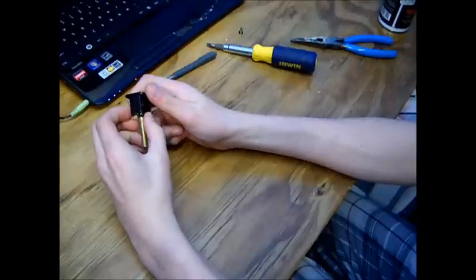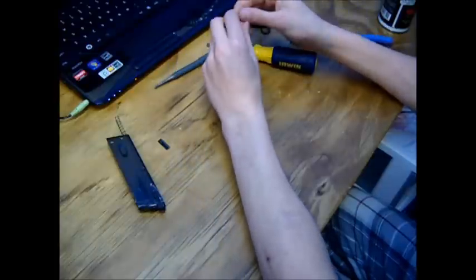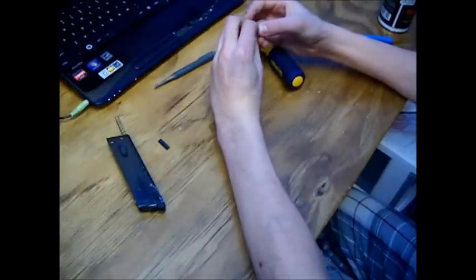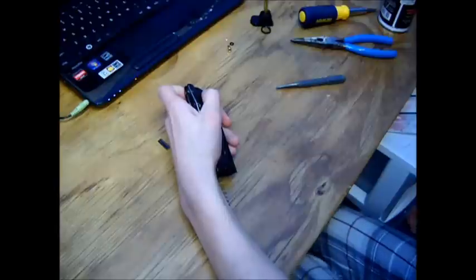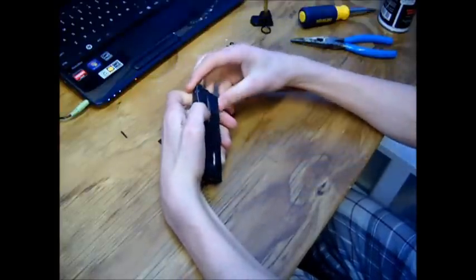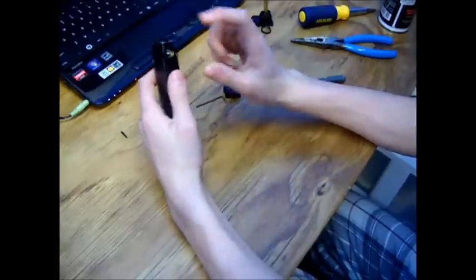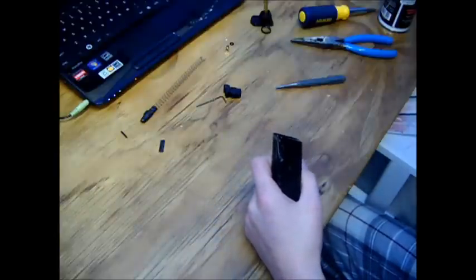And then you have an O-ring right here. This is well lubed so I don't think it's this — I think it's my fill valve. This O-ring is new so it can't be this O-ring. Now the last thing to check is the upper lip. If you find a small L-punch and punch it out, it's just one pin right here. Pop it out, and your feeding lips will come off. Your spring will slide out, and you'll have full access to the top of your discharge valve. I know for a fact that this discharge valve is not broken, so I'm not going to go into that.